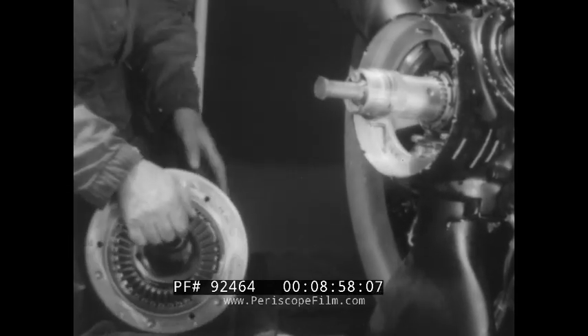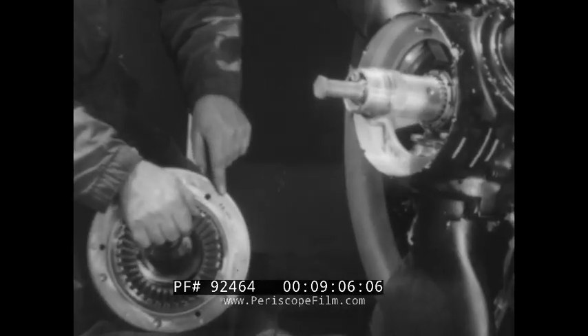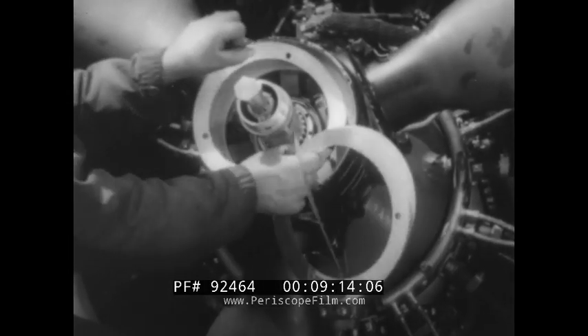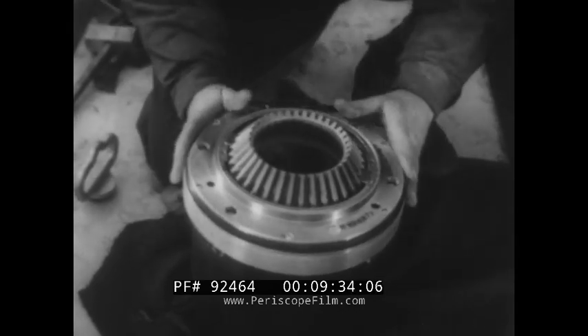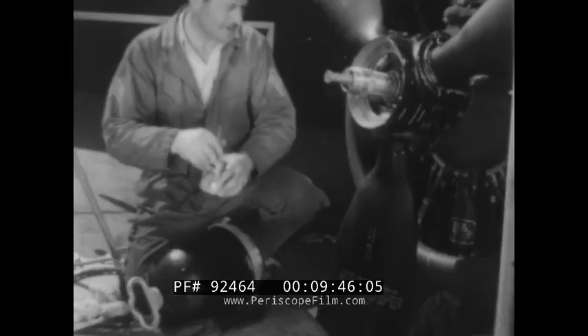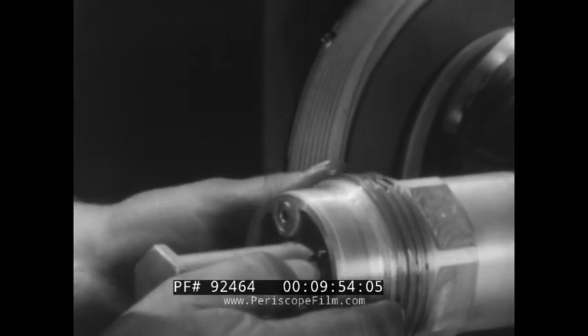There can't be more than 2 or 3 thousandths of an inch difference between the preload figure on the hub — this hub reads 432 thousandths — and the dome, which reads 454, about 20 thousandths too many. The difference is adjusted with brass shims, each 5 thousandths in thickness: 5, 10, 15, 20. Now the preload difference is only 2 thousandths instead of 22. I put this rubber seal ring on securely so no oil will spew out. The dome handle makes for a sure grip. Before Mel puts on the dome, he lubricates the three rings at the front of the oil distributor valve, then turns the rings so their slots aren't lined up with one another. Now the dome can be installed.